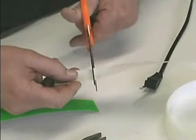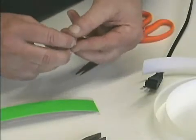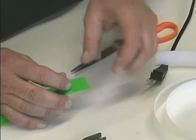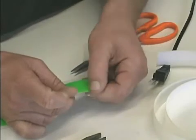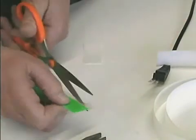It is very simple to make a connection. Just cut a piece of seal tape about an inch longer than the width of your light tape. Apply half the seal tape to the front of the lamp and fold the excess over to cover the back, making sure the end is totally insulated. Use scissors to cut off the excess seal tape ends.